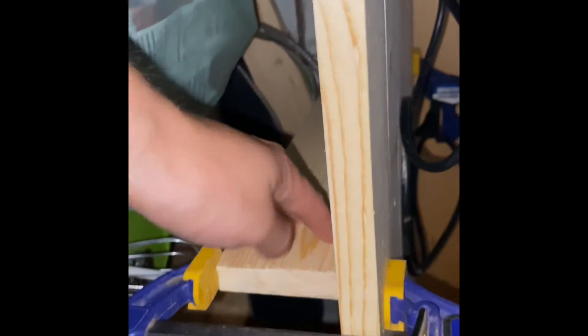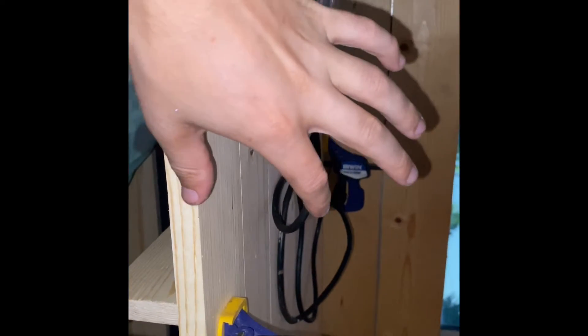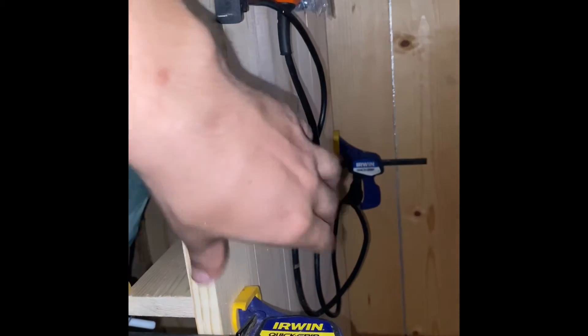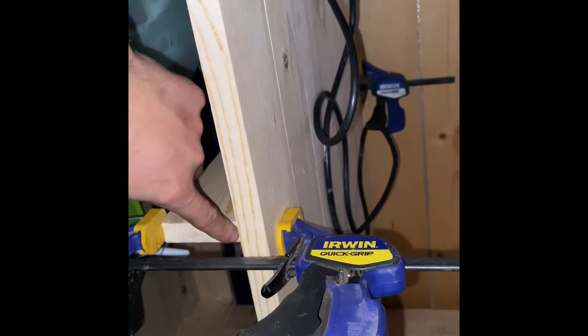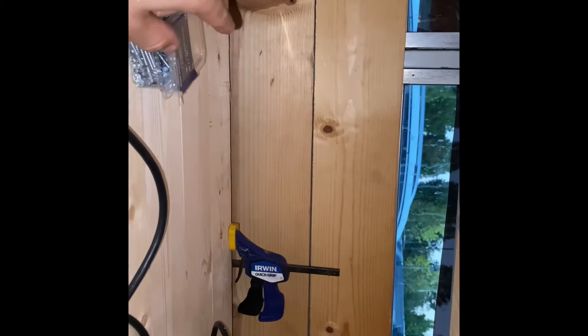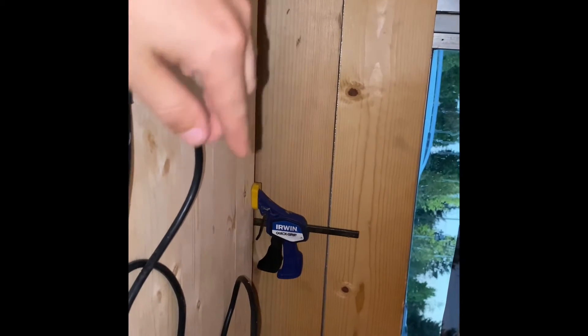It's not going to be touching the ground there. I have a one by four that's going to sit on the edge of the shelf here, and that'll keep things from falling off, but it will also add some stiffness. If I can get this board to be stiff enough, it will transfer the load onto this vertical board here. At the very back, I'm doing something similar, except instead of having a vertical support, that back plank on the shelf actually touches the wall.